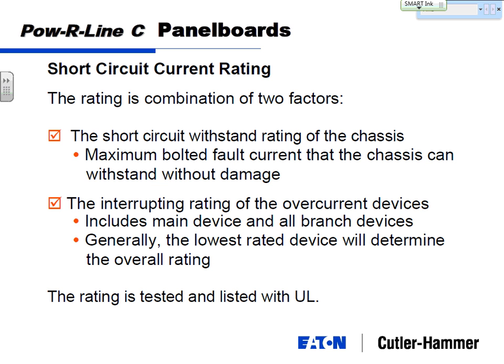This is a 400 amp circuit breaker, just to give you some sizing. This is a 225 amp circuit breaker and a 400 amp circuit breaker. 400 amp circuit breakers is always when we start to have an interchangeable type trip unit. So there's a circuit breaker, big frame, heavy molded case. And one of the reasons you do that is if you put 65,000 amps, you have to have a lot of rigid, I'll call it engineered thermal resin composite plastic, holding this thing together so it stays in one piece while those contacts on the inside separate.